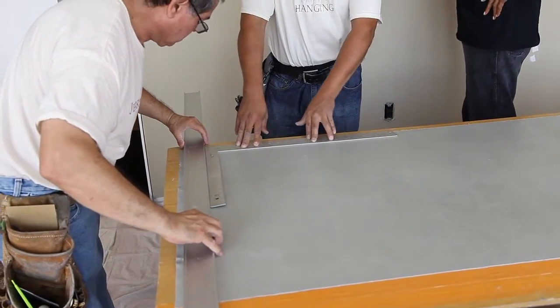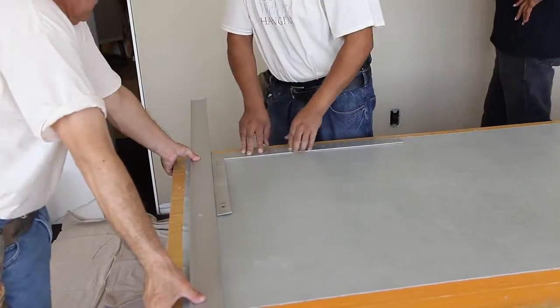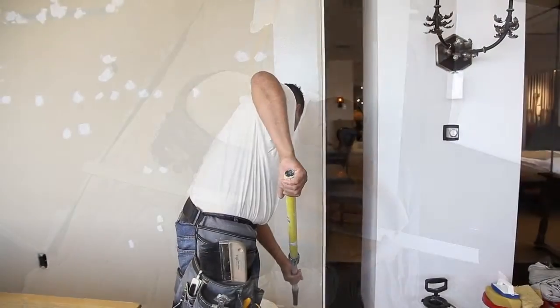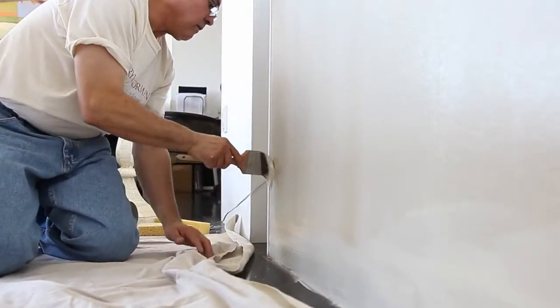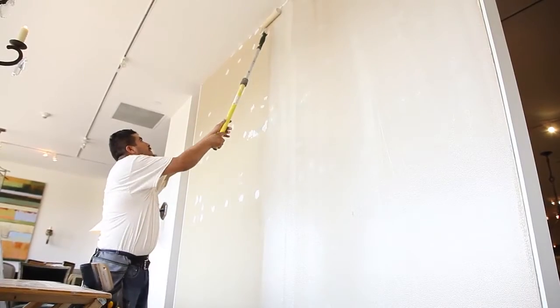It's difficult to cut at the ceiling, so we're pre-cutting a right angle so that it can butt against the ceiling and have a cleaner look. We're using a clay-based wall covering adhesive and we've watered it down just a little bit to size the wall, and we'll use the same product at full strength to hang the wall covering.